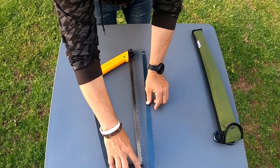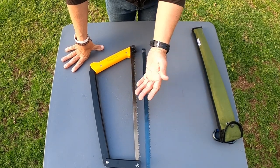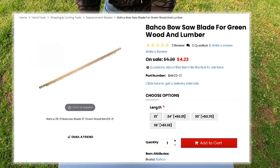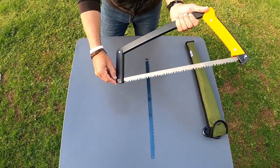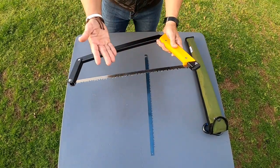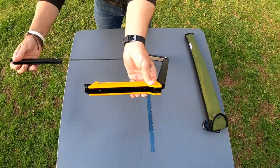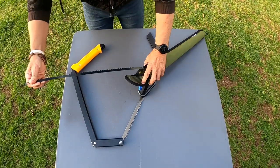Be careful handling these blades. It's very easy to replace the blade in this thing. What also makes a bow saw or buck saw so good is the fact that when you do dull a blade, you can get replacement blades at any hardware store — they only run about six to seven bucks. You never need to sharpen it. You can change it with practically nothing — even the edge of a rock. All it is is a couple little C-clips and it pops right off.